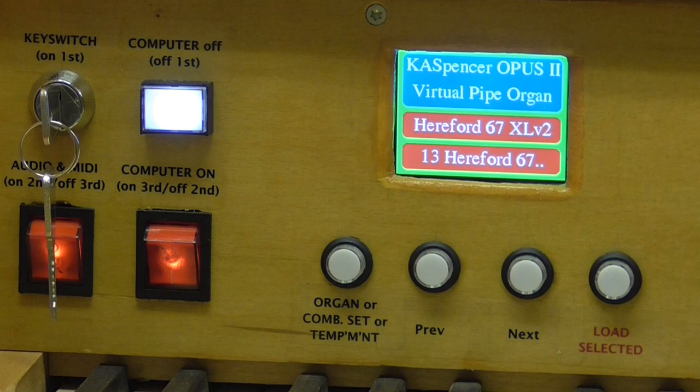And then in the pedal board, we have got an Arduino Nano, and the Arduino Nano not only handles the pedal board, but it also handles the expression pedals, which actually are very good and well designed because they use Hall effect magnetic sensors, which means there's nothing mechanical to wear out or become damaged. Everybody knows one of the problems with using potentiometers, in particular, as the control for expression pedals is they do have a tendency to wear out. So there we are. So let's carry on along here.